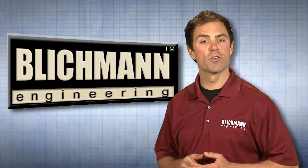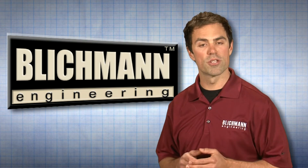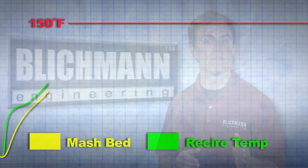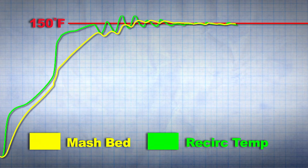Please note that as you ramp toward your chosen temperature, the burner will remain on until you approach the set point. Within a degree of the set point, the controller will go into a 30-second cycle mode. You will notice a slight temperature overshoot of the return wort; however, the temp of the mash will always stay within a 0.5 degree tolerance band.